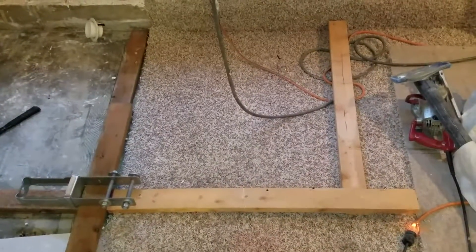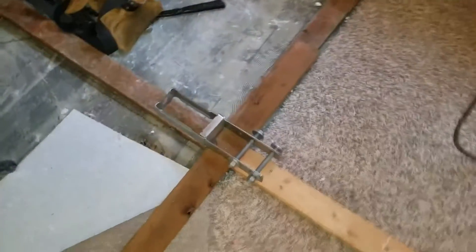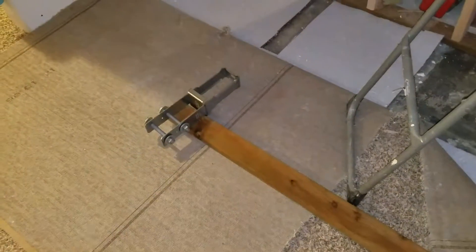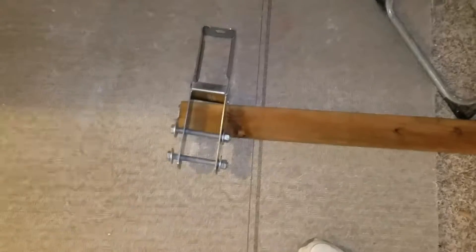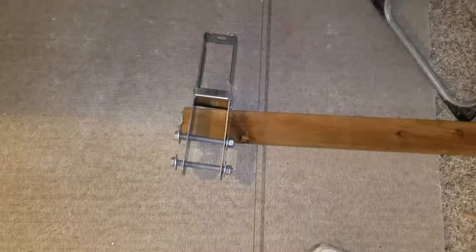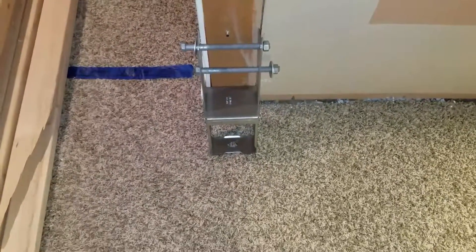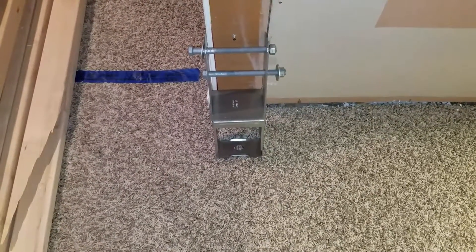This is the layout of the framing for the new stairway. We have one 4x4 post goes here and another 4x4 post goes there. This one is specified to get a 12x12x8 inch footing. This one is to get an 18x18x12 inch footing. And this is an existing 6x6 that gets a 3 foot square by 12 inch deep footing built under it.